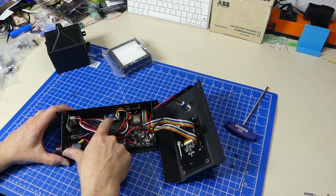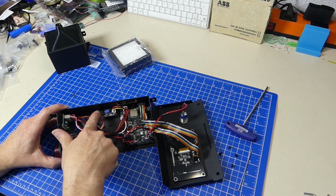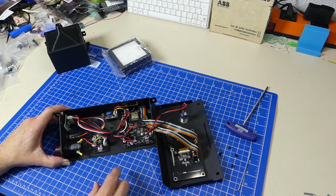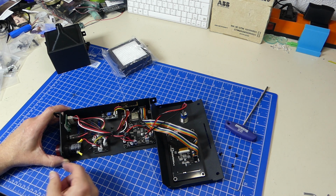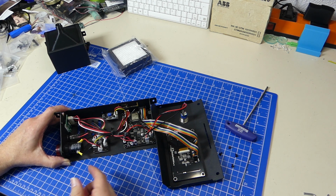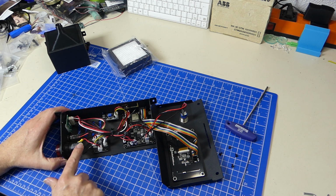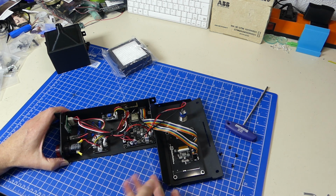And I'm told that this is a flame detector. So what it does is it's got a sensor looking out onto your build platform. And if it detects a high amount of infrared radiation from something burning, it's gonna signal the microcontroller, and the microcontroller is going to go into an alarm mode. And that's the last component here. That's a buzzer beeper, and I think this thing is gonna be really, really loud if that alarm goes off. Apart from that, there's nothing more.